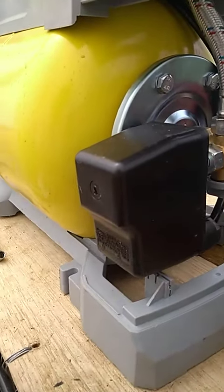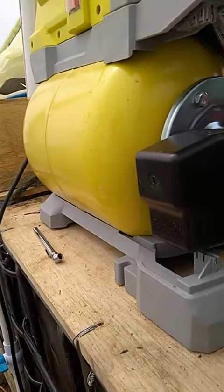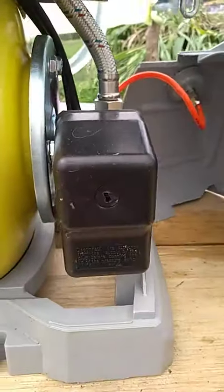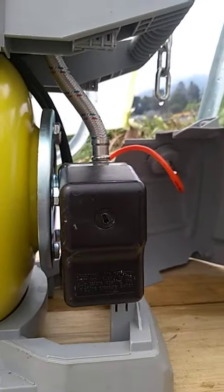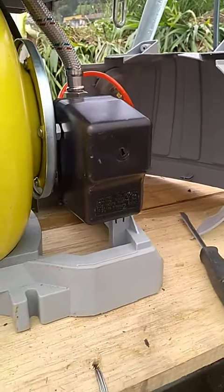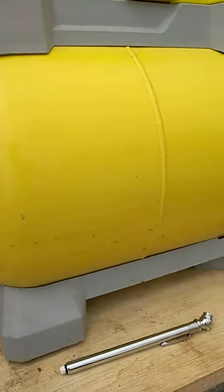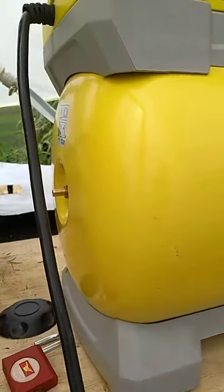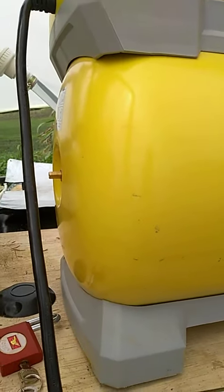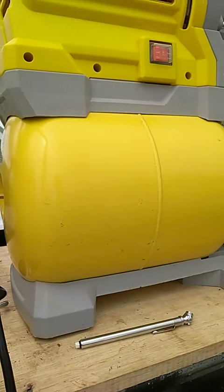This is the pressure regulator right here. It's the only thing that it has to be — it's not letting us adjust. There's the adjustment screw; we've gone both ways with it and still it won't go past 42-43 pounds, when we should be able to get it up to 60-65. We did increase the pressure inside the tank through the valve to 65, but it didn't make any difference whatsoever.